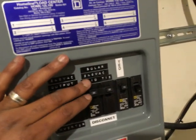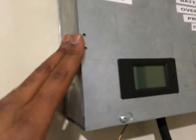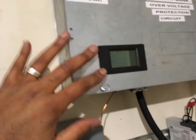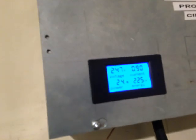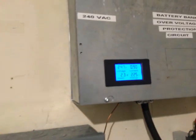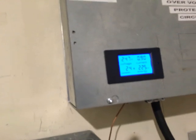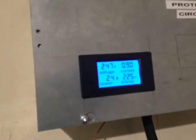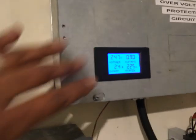Even though it's still on and the wires are coming down, it's not powered up at all - it should be energizing this particular meter, but it's dead. If I flip the inverter output back on, it comes back on. That right there is what it means to have a certified micro grid-tie inverter - when no power source or synchronization is available, like utility or in this case my inverter charger, the grid-tie inverter shuts off.